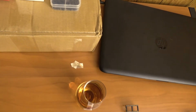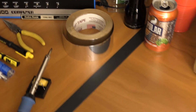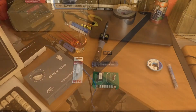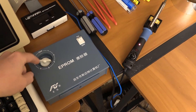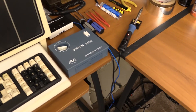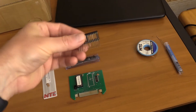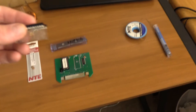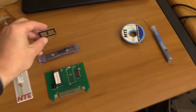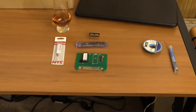For those of you wondering, the foil behind the whiskey - that's a bourbon - is just HVAC foil tape. It works really well, it peels on and off easily. So let's get to it. We have our assortment of components here. The soldering iron is already warm. My EPROM burner is ready to go - this is a weird cheap knockoff one that does work, but the timer just pretends it's on or off. I have my ROMs and my socket. This is actually a prototyping socket - the place I usually frequent didn't have any more traditional dual-wipe sockets. I've got some caps for C3 there on the board, and my solder and wick in case I make any mistakes.